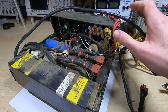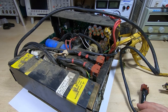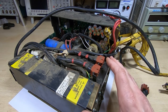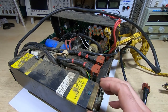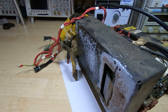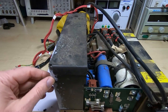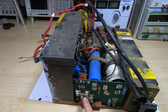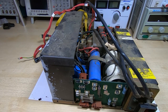In this video I'm going to start looking at the power supply, which is in the same sort of condition that the rest of the machine is in. Not quite as bad as it looks perhaps, but still quite a lot of things that need doing, so I'll need to strip it right down. There's some fairly bad corrosion on the back of the machine, so I'll be removing and refinishing this part — blasting it back to bare metal and repainting it. I've checked all the fuses; they're all intact, which is a good sign. It means there wasn't anything catastrophically wrong when it was last used, though it doesn't mean there isn't now.